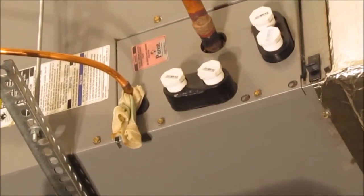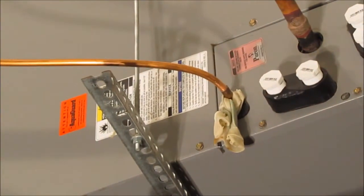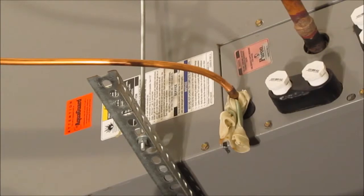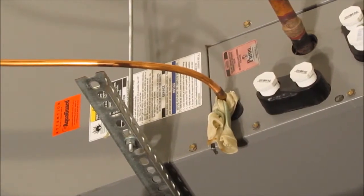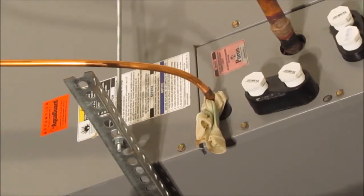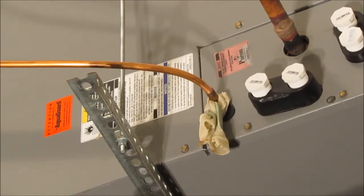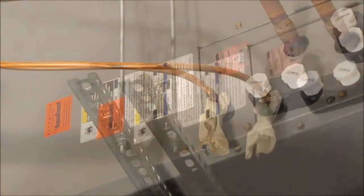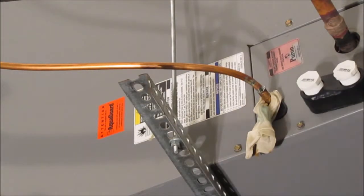And so it's not rocket science, but I like this soft soldering because there's no nitrogen. The heat's a lot lower. Really, I got a rag wrapped around the fitting there that goes to the TXV valve, but it probably doesn't even need it because it doesn't get as hot as when you're brazing. So let me do that one first. Okay. That's done.